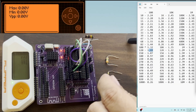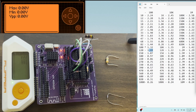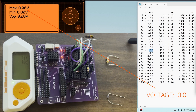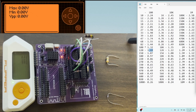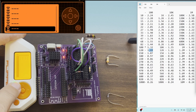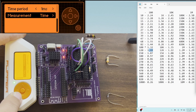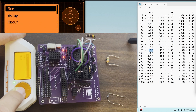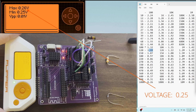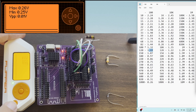Now we'll remove that first resistor and plug in the second one to see what its measurement is. We're getting a reading of 0 volts, which means it must be more than 1000 ohms. So we'll exit the scope, edit our range, and go to the 10k resistor. Then we'll launch Flipper Scope again, go into setup, and change our measurement to voltage. This time we can see the voltage is about 0.25 to 0.26 volts. In the second column, 0.24 is 100k, which is correct for a brown-black-yellow resistor.